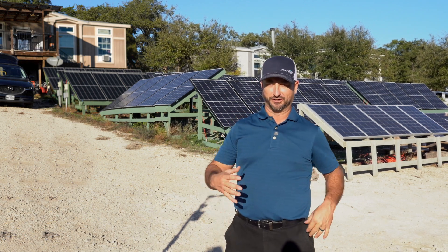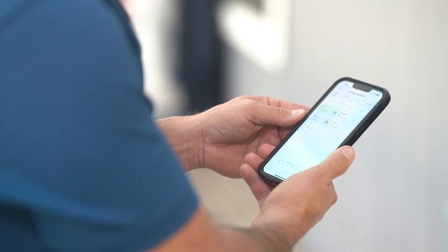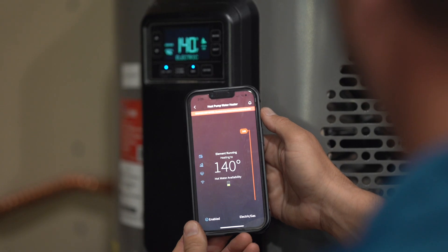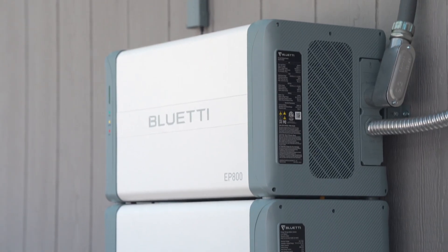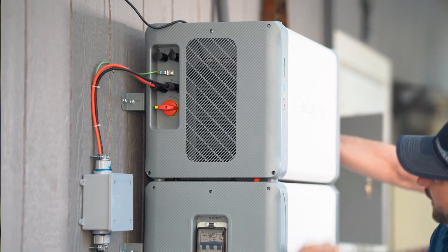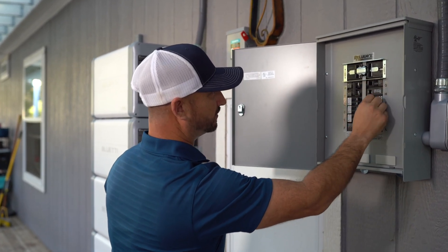Very portable, very easy installation — I highly recommend it. Props to Bluetti for how modular it is; it's like Legos basically. Getting the EP800 started up, booted up, logging into the app for the first time — piece of cake. It took me less than 60 seconds to have it communicating with my iPhone. The EP800 is an all-in-one unit — solar charge controllers are already built in, the batteries, all the breakers, the inverter, and even the transfer switch so it can go from grid to solar seamlessly. A generator can be used on it as well. It's not a bird's nest of wiring like some systems on YouTube — it's a very clean install that looks great on your wall.